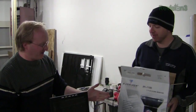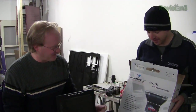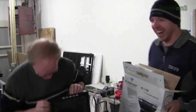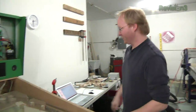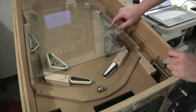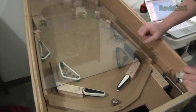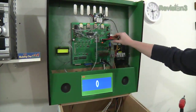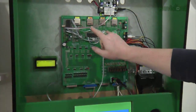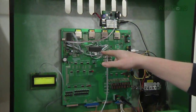It looks like we've got a screen for the pinball machine. I found it from eBay — they have a lot of these, which means it's a commodity item you can easily find again. Using commodity items, you can make more pinball machines. I've made some progress: I've wired everything into the main switch, there's a power strip inside, and a power supply for most components — 50 volt for the solenoids. I have all three processors hooked up and working: CPU, audio, and video. I just got the commands communicating.